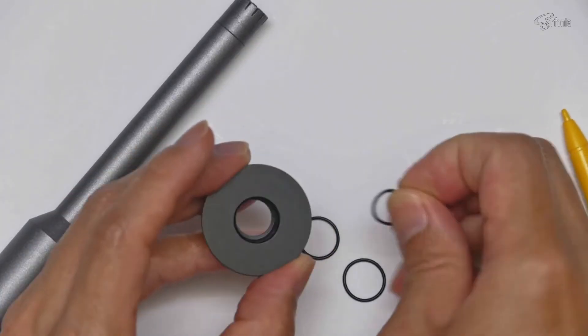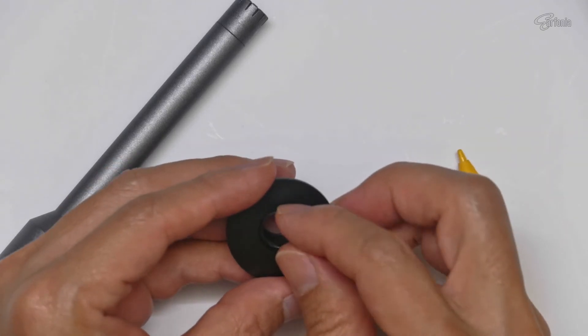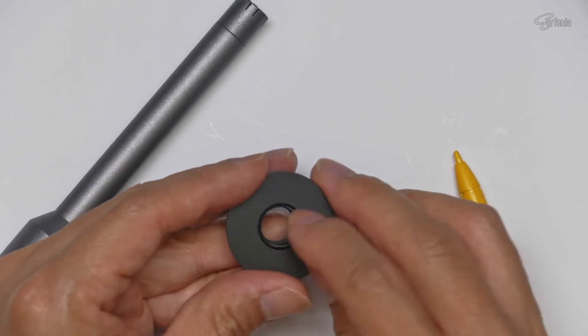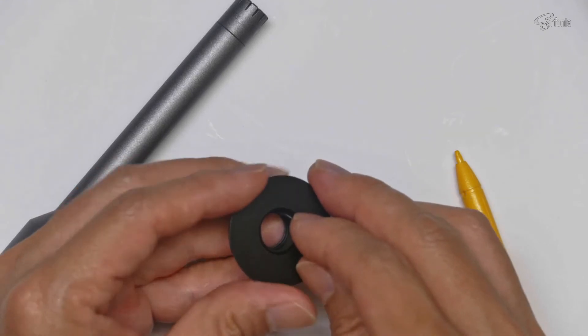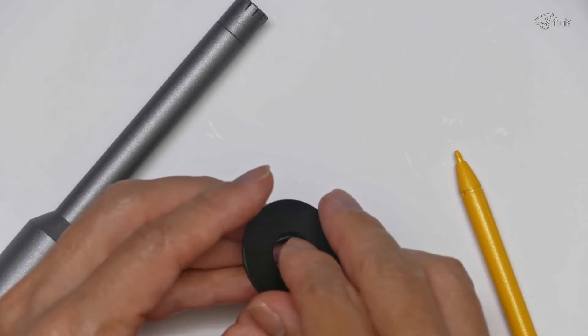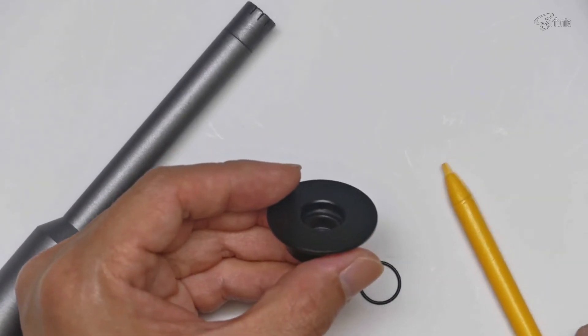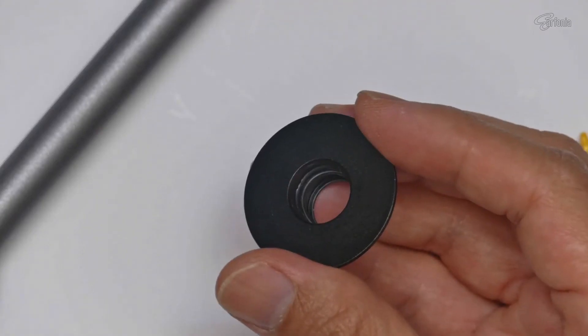To improve the fitting I use 14mm O-rings. I tried putting between one and four O-rings inside the adapter. I did multiple measurements for five different fittings: without O-ring, and with one, two, three, and up to four O-rings.